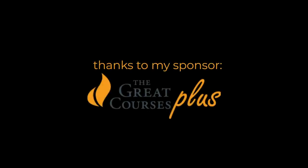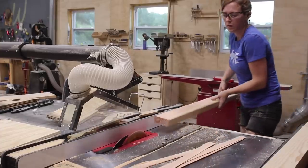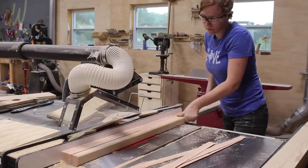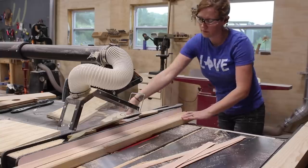Let's pick up right where I left off, which is making the roosting bars. On the last coop I built, I ran dowels across in a ladder formation coming up from the ground and leaning into the wall. You just have to make sure you don't go smaller than two inches in diameter, or it's bad for their feet.